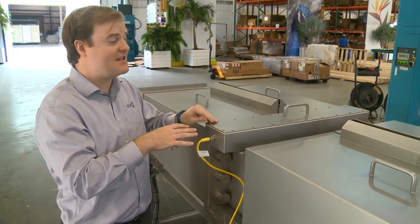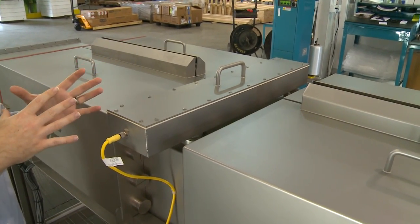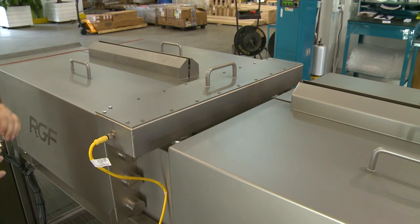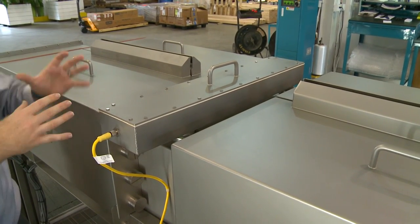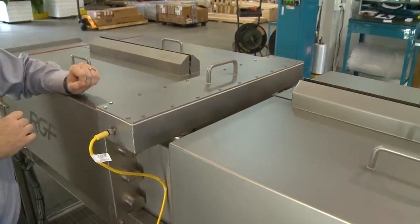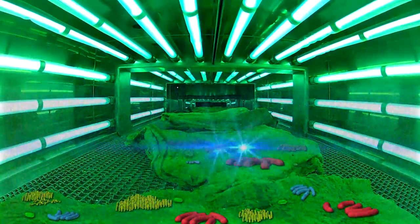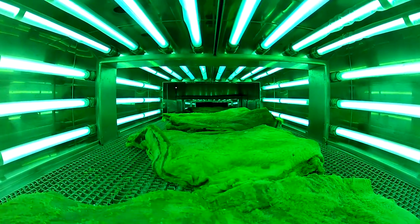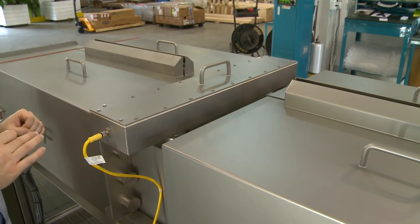What this actually contains is a PHI cell. It's a UV lamp shining on our patented coating or catalyst. That's going to create PHI gases — Photohydroionization — basically vaporized hydrogen peroxide. That's going to go into the system where the food is going through, mix with the UV energy, and create advanced oxidation. That's going to give you the maximum effectiveness of our machine.